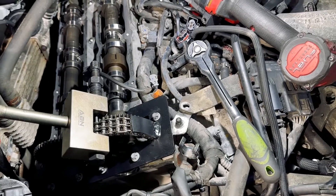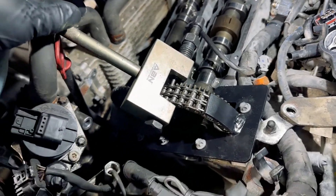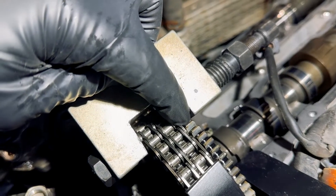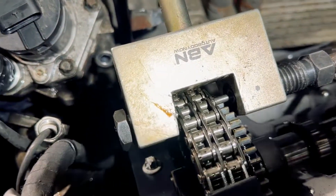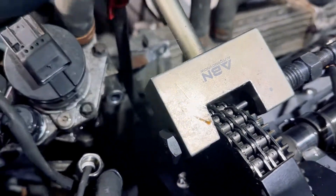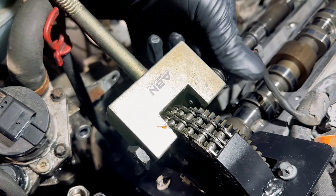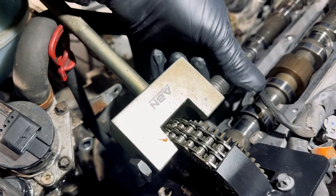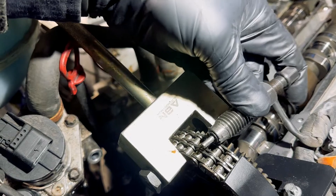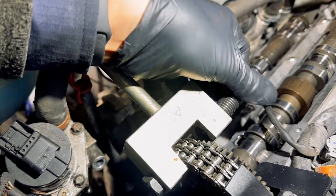We're using our shop-made chain tool to hold the chain as close as possible to the pocket, and we're taking the first tool from our Chinese set — this is the tool to disconnect the chain. You'll see it's designed so it just touches this pocket on the side, but you'll have to slightly grind the edge of the tool in order to slide it on top of this pocket. Also, when you start disconnecting, the tool will touch the teeth of this pocket. I grind it a little bit so you can slide off and move through the teeth all the way to push that pin and disconnect the chain.